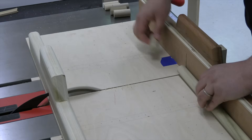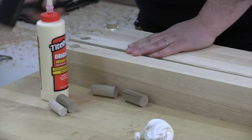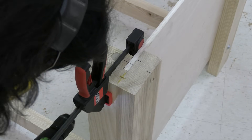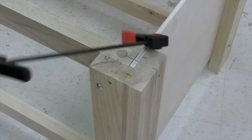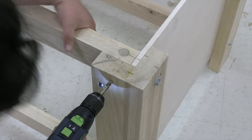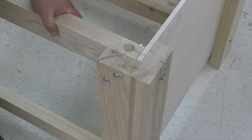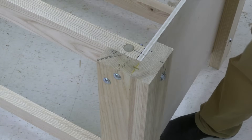In those long stretchers, I'm embedding a dowel that goes cross-grain from the stretcher, giving me side grain to screw into with a lag bolt. Each leg gets two carriage bolts through the side of the stretcher and one lag bolt through the end of the stretcher into that cross-grain dowel. I wanted to do this because it makes assembly simple, doesn't require a lot of special hardware, but you could take it apart if ever needed — make it longer, make it smaller — it's a strong knockdown assembly.